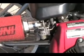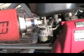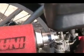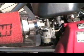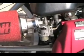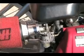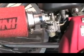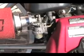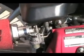Third thing, that's not even the original carburetor. I actually broke the original carburetor before I was using it on the bike because I tried to modify it. So I got a go-kart carburetor off like a 125cc Honda 5 horse. I'm not sure exactly the cc it's on, but it's probably got a jet for like 4 horsepower, and the hole for the carburetor is probably very slightly bigger, if not the same size.